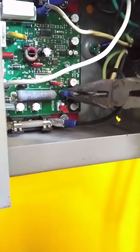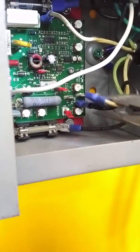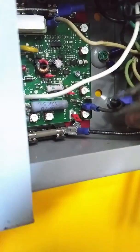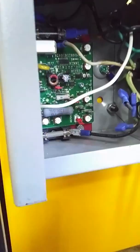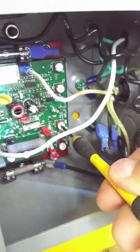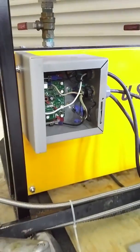Now you remove terminals P1, P2, and P3 off the panel. Set those aside. There's also a small minimum speed control pot — you'll actually need to turn that up about halfway. Now the machine will run at its minimum speed, which is half speed.